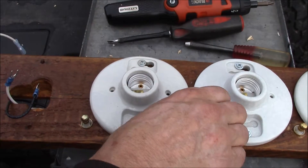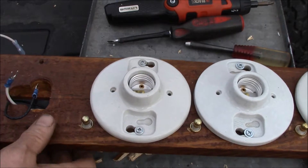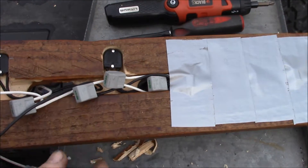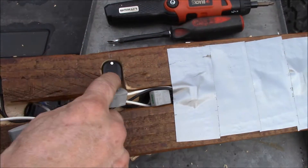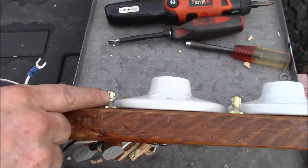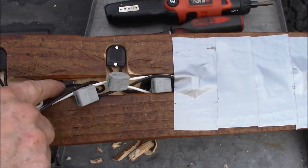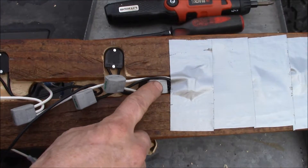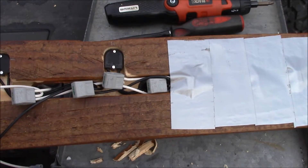What I did was put some little rotary switches here, so I have a switch per socket. To mount everything, I took about an inch-and-a-quarter board that I found and machined some slots in it for the switches — you can see those there. Then I cut some holes to run the wires to the sockets, and I have all my wiring going into little WAGO three-terminal connector blocks.